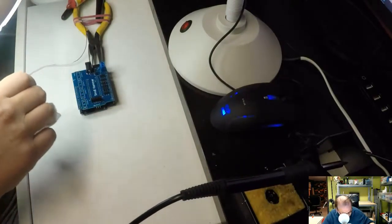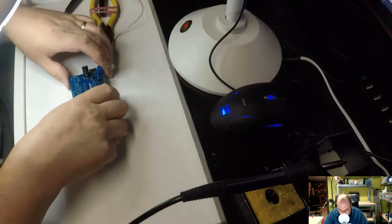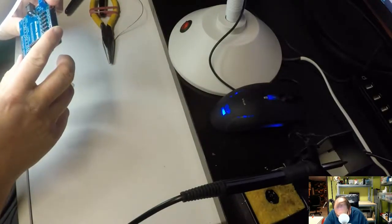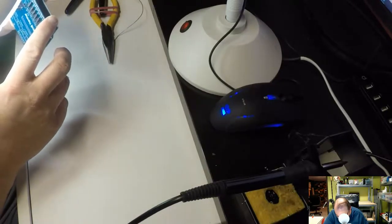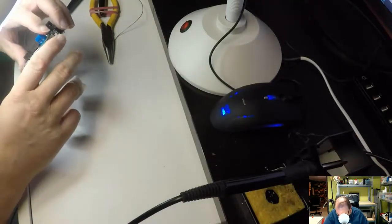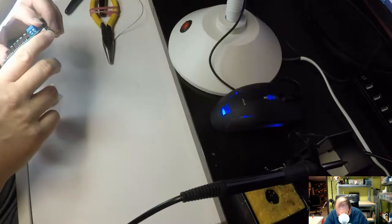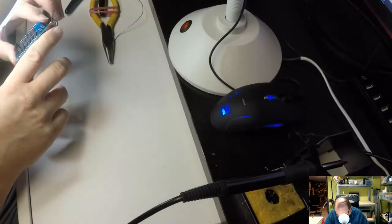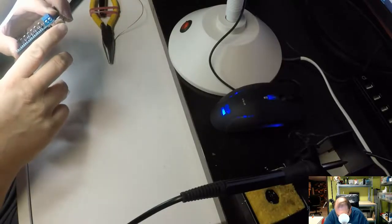I'll just have to check through and see that they are actually soldered. Don't see anything. No solder bridges, which means connecting two connections that are not supposed to be together. No extra crap, like solder that has disconnected itself and is just hanging, because that's conductive.